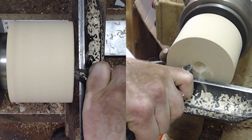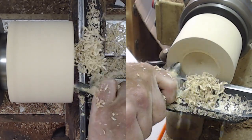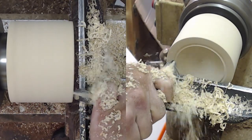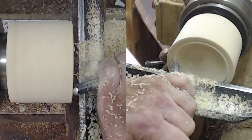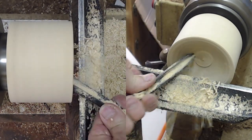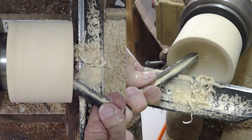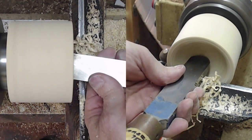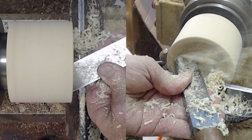Using your bowl gouge, hollow out the jam chuck to create an area to hold the sphere. This is like making a small end grain bowl. Since this is end grain, the cuts can be more difficult than on a standard side grain bowl. Take your time and take smaller cuts. The rim of the jam chuck does all of the holding, so the rest of the curve isn't as important. A round nose scraper or round carbide cutter can be used to refine the hollowed out area.